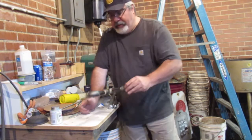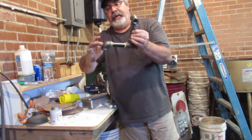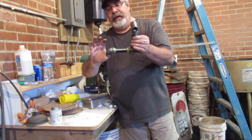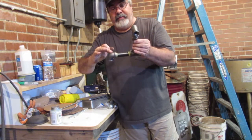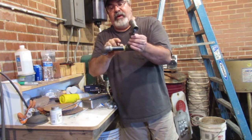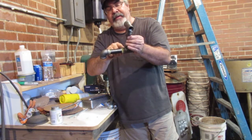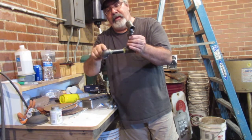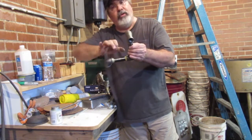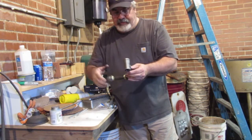And a lot of times, like when I was putting this pipe in this elbow, it's a 90-degree elbow. They got 45s, 22.5s too. When I was putting this on, I basically held this T and twisted it, so I was putting the nipple into the T and turning that 90-degree fitting on all at one time. So you don't have to put the nipple on first and then go over and do that. That's kind of a little trick.